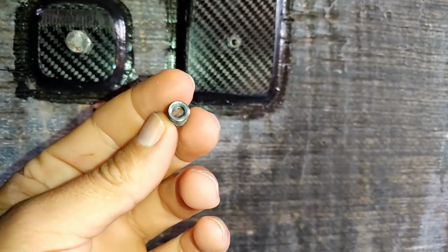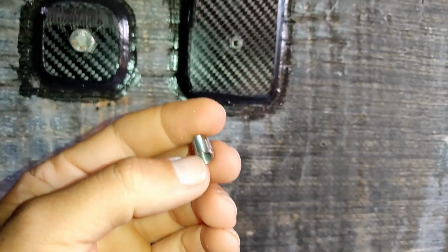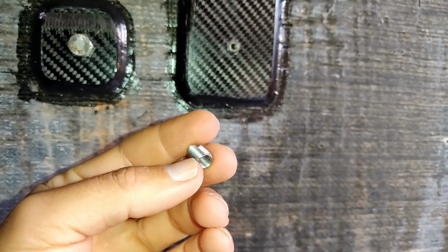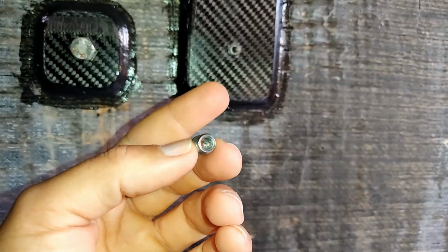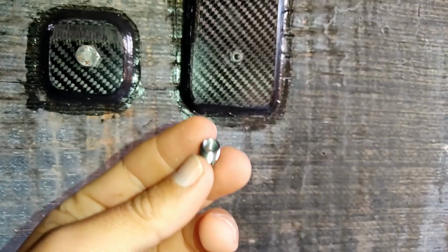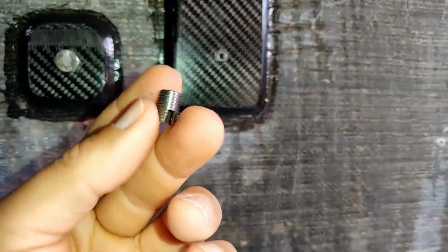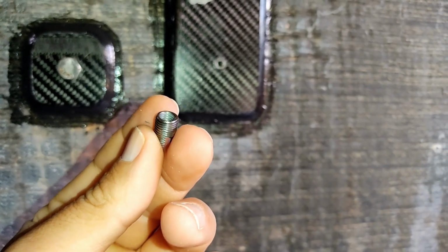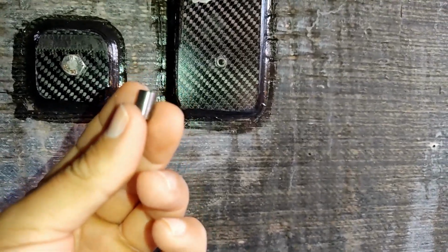What it also does is increase our bearing area. So instead of a 6mm hole and thread, it's actually an 8mm hole and thread on the outside. So it's the equivalent of a bigger bolt holding into the carbon with a smaller bolt actually going through it. It strengthens our connection to the carbon, so it's quite advantageous. Now, these have their own downfalls. They're a little bit tricky to fit at times. And sometimes...